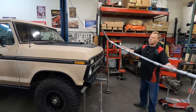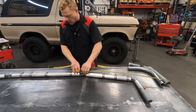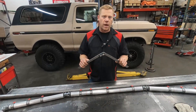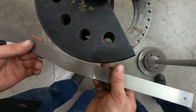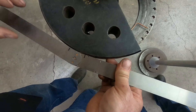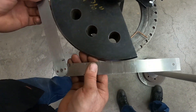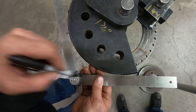First things first is to figure out how much material we're going to use — it's pretty easy to just run a tape measure over here. We got our tubing cut, and all of our numbers written down as far as distances and bend angles. The next thing to do is to use our angle finder on our die to figure out where the tangent of our bends is. 12 degrees is our first number. We hold it on our die and mark those contact points — that's going to be the tangent of our bend. The next number we're looking for is 75 degrees, and same thing — we put this on the bender on our die. Those contact points verify they're the same, and that is our tangent point from the center of the bend.